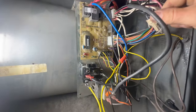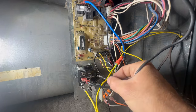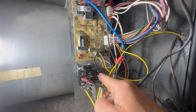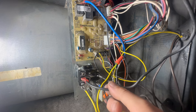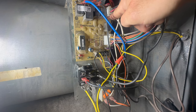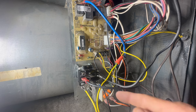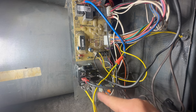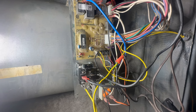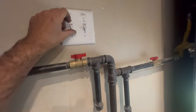Okay, let's double-check all the wiring. Incoming power, 120 volts, is coming to terminal six. This is normally open, so there's no connection — this wire goes directly to the motor. Our motor still has a neutral hooked up to complete the circuit. When we get a call for fan, this coil is going to energize, closing the circuit. Let's turn it on and see if it worked.